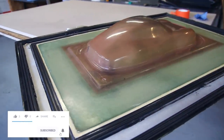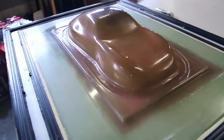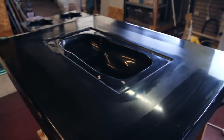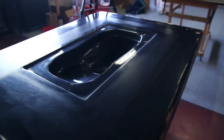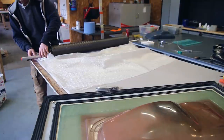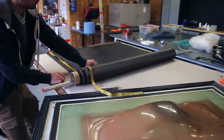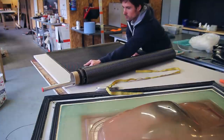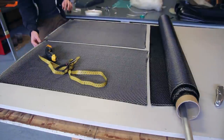First, we had the positive mold — I polished it to get a good shine that will be the back of the part, and the release agent was applied on both sides. Here is the negative mold with just the space of the part in between. The process is quite similar to the previous infusion video, but we won't need peel ply, infusion mesh, or a vacuum bag, because all of these will be covered by our positive mold creating back pressure into the cavity.